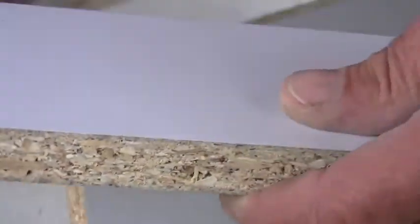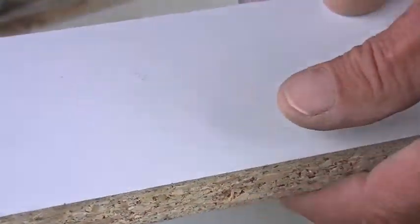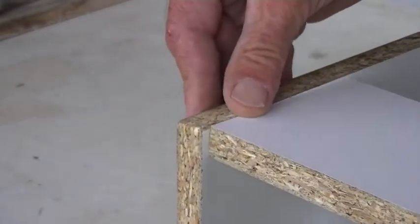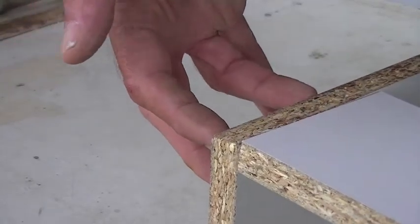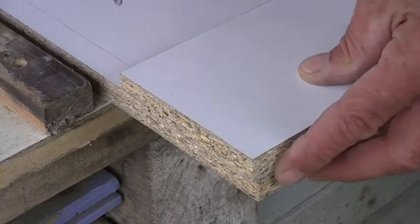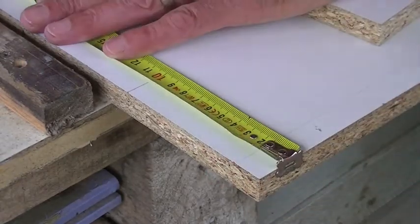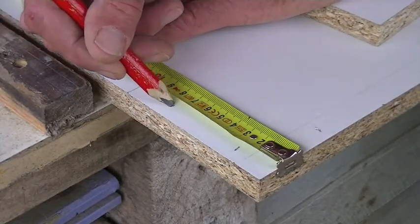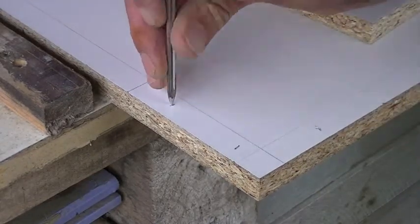I haven't spoken about the tops yet, but you can see it's a very thin, narrow piece — it's only 10 centimeters wide — but it also gets put onto the sides with two screws on the end. So we'll make a mark for that: it's 10 centimeters wide, so we'll mark at 2.5 and at 7.5, and that's where the side screws are going to go in.